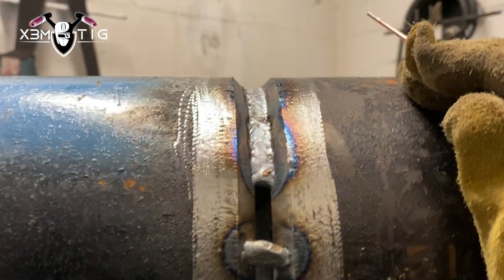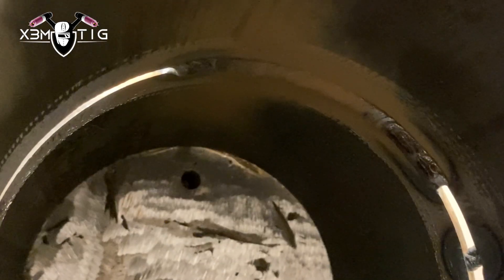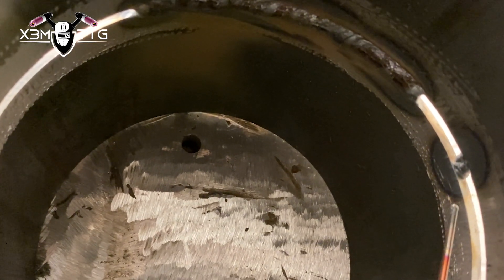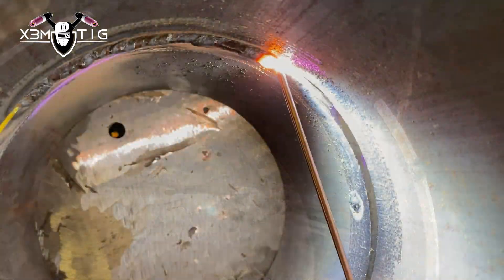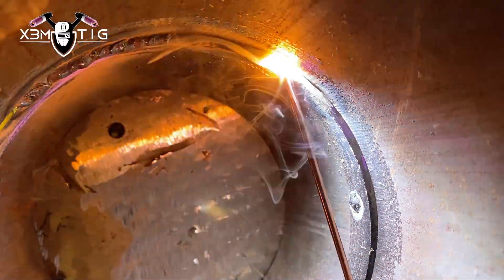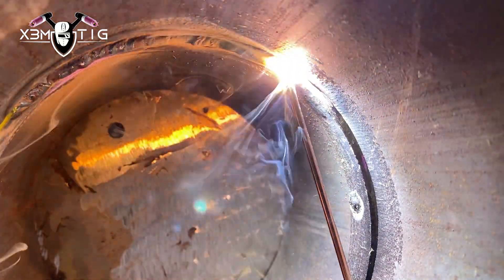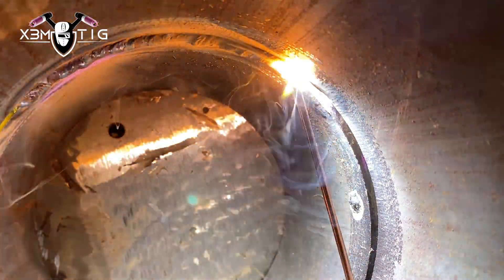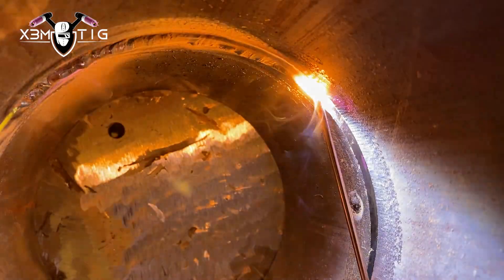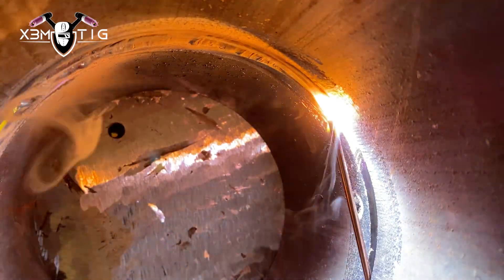Now we're going to cut the tack and continue down. One of the biggest questions is whether you can run TIG downhill — in the TIG welding process there are no contaminating properties, which allows the welder to perform both uphill and downhill welds. Uphill is the preferred technique because it allows for better penetration of the weld joint, which is why it's in all welding procedures and specifications. On your ticket it always says uphill TIG F6, F5 — it always says uphill, not downhill. Downhill is mostly on pipeline with 6010, but lots of TIG welders in the shop, including myself, always do downhill root in position or in a wheel — it's way faster.